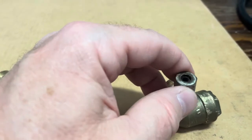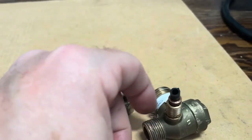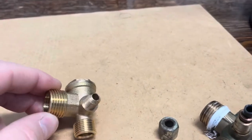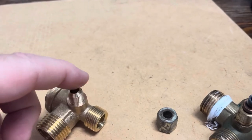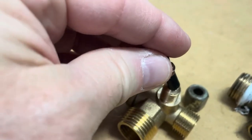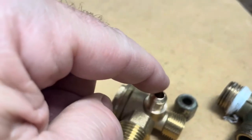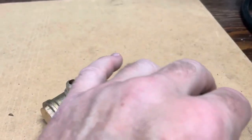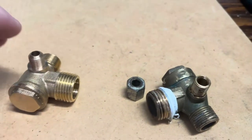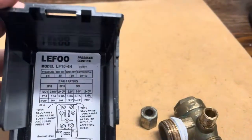The new one is a little bit different. Look on Amazon to see which one matches closest to what you have. There's another one I bought that didn't work — it has a flare on the end which won't work here because you don't have a flare. If you were skilled you could probably drill it out, but I prefer to get the one with the compression fitting that has a female part on the bottom and the top part screws in.